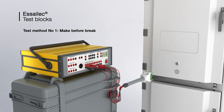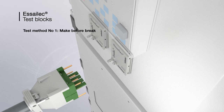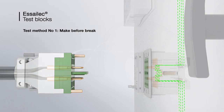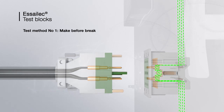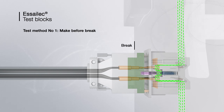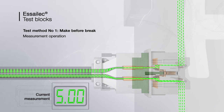Connect first the pre-wired plug to the test set. The lid is removed without interrupting the circuits. Insert the plug into the socket to disconnect the circuits. During insertion, the plug's pins make contact with the socket and the signal still flows through the socket. As the plug is pushed further, socket circuits are disconnected and the signal flows now through the plug towards the test set.